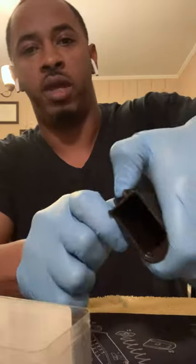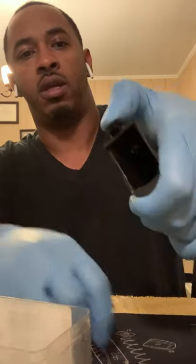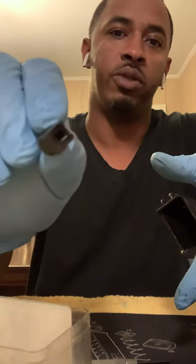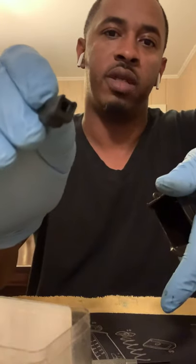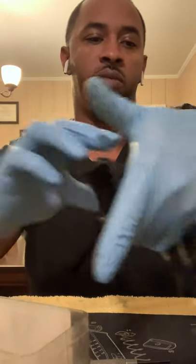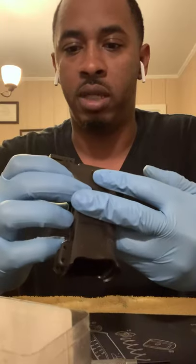Old pin there. Hold your finger over that, because you don't want it to just go flying out when you pull that out. It's a little cup for your hammer spring. Your hammer fits inside that little slot. Make sure it's back in there, right? Remove your hammer spring.